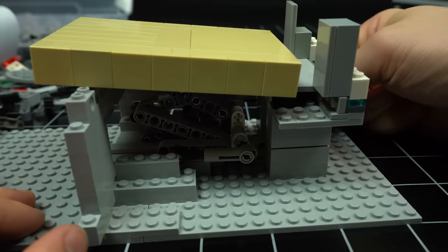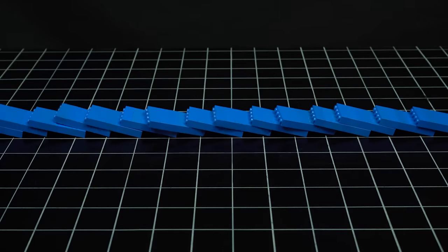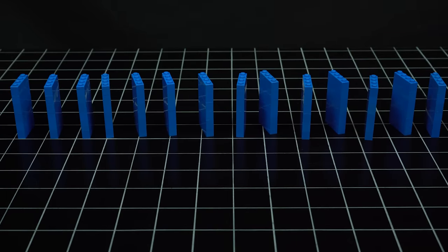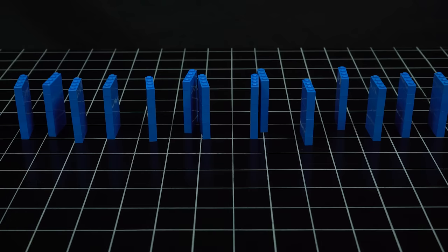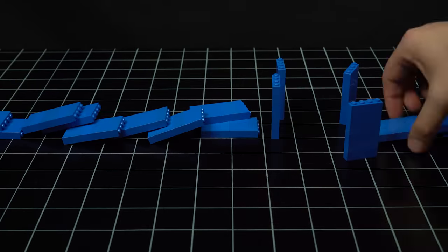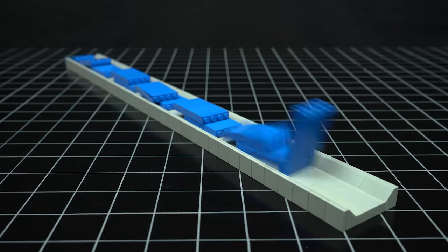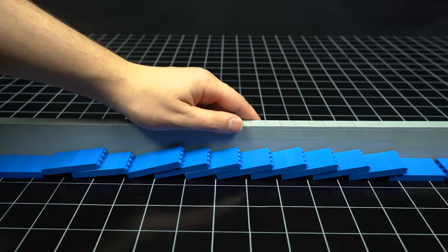This machine had so many issues. The problem is that when dominoes fall, they are randomly angled and unevenly spaced. If you were to lift the dominoes up exactly where they landed, they would also be slightly misaligned. This error is compounded each time the dominoes are pushed down, so you quickly create a scattering of dominoes that fails to work after just a few resets. I can't even begin working on a mechanism to push the dominoes up unless I figure out how to stop them from scattering.